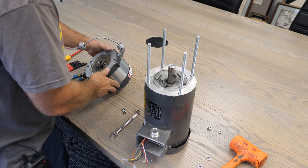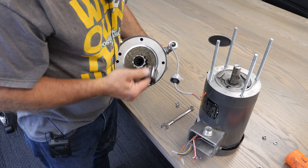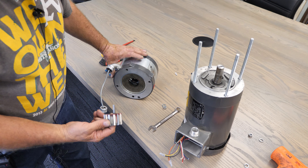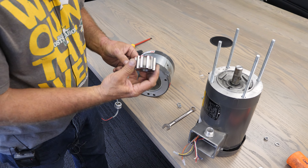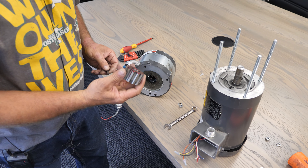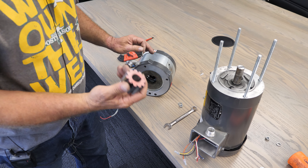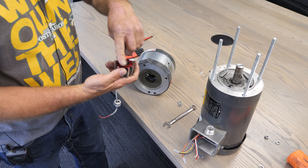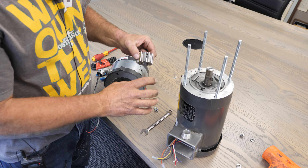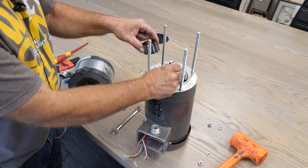You can see this is the inside of the brake. Now, when you get a new brake, it's going to come with a little gear that's going to be smaller than this one. What we found is they're made out of pot metal and they break. So when you buy one from us, get the modified brake version — it comes with a steel gear. We paint it red so it stands out, and we designed this gear to be longer than the others so when you drop it down onto the motor shaft, it's already set for you.